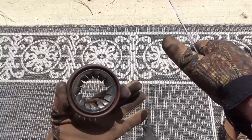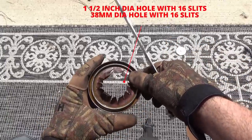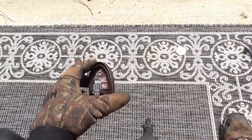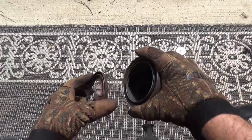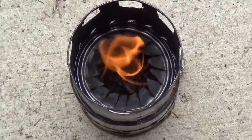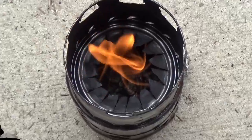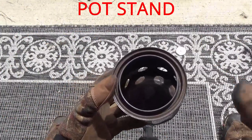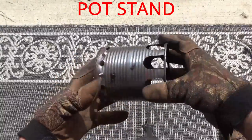Now we're talking about the flame concentrator. That flame concentrator has an inch and a half hole through the center — about 38 millimeters — and 16 slits. Those 16 slits move in towards the outside of the lid, and they're twisted up and then twisted sideways to help the flame spin around.